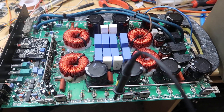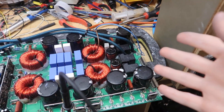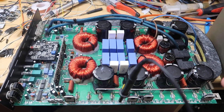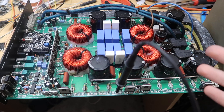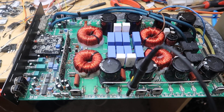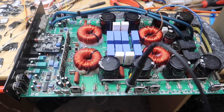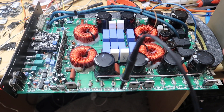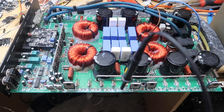Powering these things up when you've just fitted MOSFETs or drivers or anything new with the high voltage rails from a 12-volt battery supply or power supply can be a bit daunting and nerve-wracking, because if anything goes wrong, there's incredibly high voltage and high current there waiting to kill your new parts, blow up, and cause loads of sparks and smoke. So because I've got this new power supply, I thought I'm pretty sure I can actually just get this output section up and running using just the plus minus 17 volts, which is what I've done here.